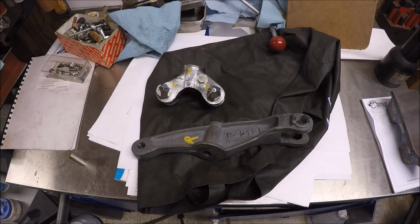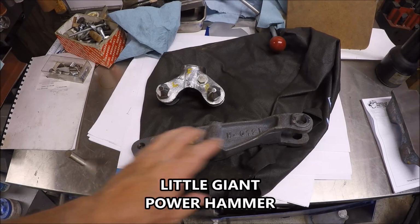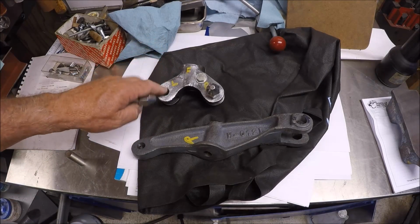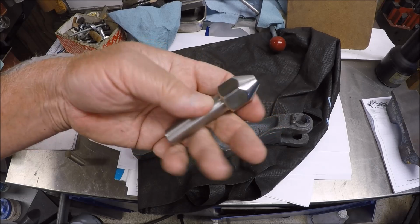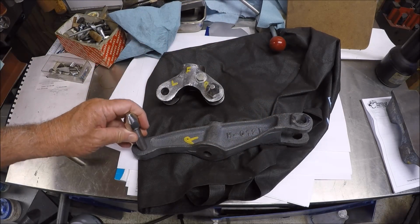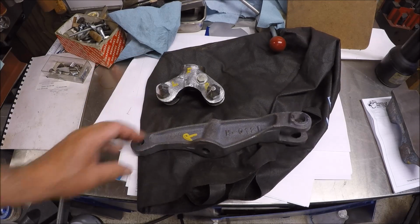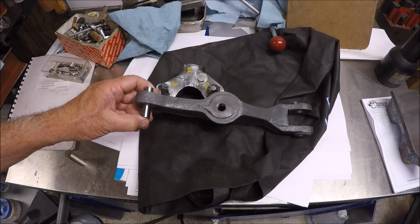Well, I was talking about friends, and let's go on to my good buddy Flea Market Dave. He just went on a vacation, and he says, hey, while I'm gone, maybe you can get this done for me. These are off his little giant power arm, and there's a video where we were boring these, and we did this guy, and he's made pins for it. Made these out of stainless and hex stock. Well, these pins need to fit right here. So it's really a puzzle again about alignment. I've got a gauge pin that fits this guy over here, so I've got a gauge pin for alignment.